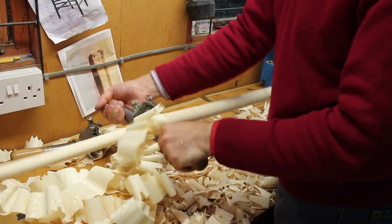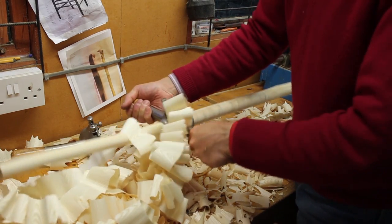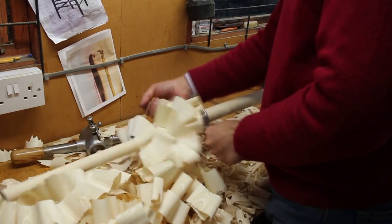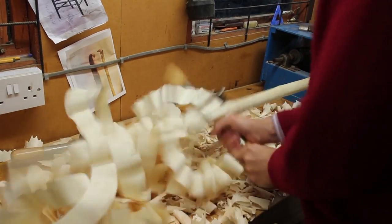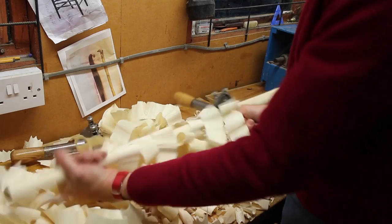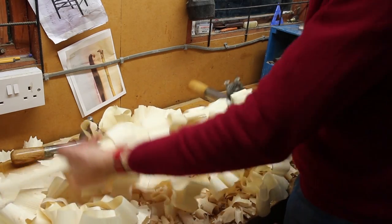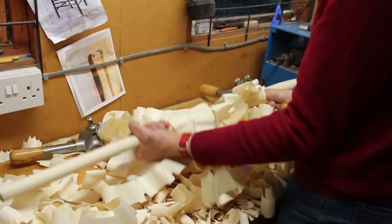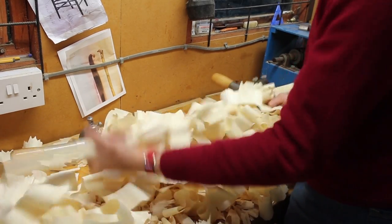It's the moisture content. I often compare it to a tissue — if it's dry it's quite hard to break, but if you soak it in water and try to pull it apart it goes really easily. It's the same sort of thing with this wood because it's green. I know I'll get comments about not using a steady — I have actually made one, I'll show you in a minute. Look at this shaving just peeling off and I'm getting quite a nice round dowel effect.